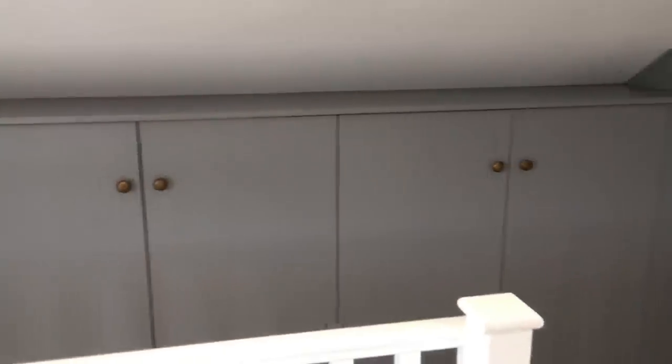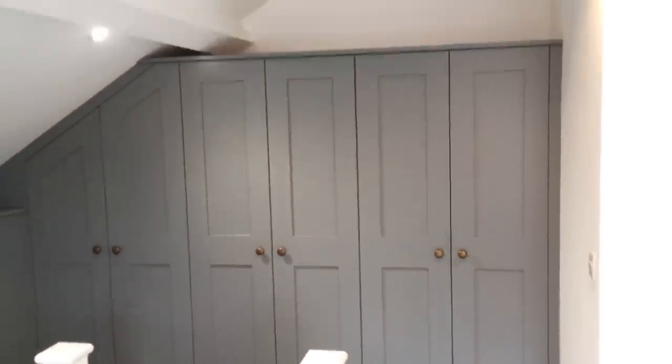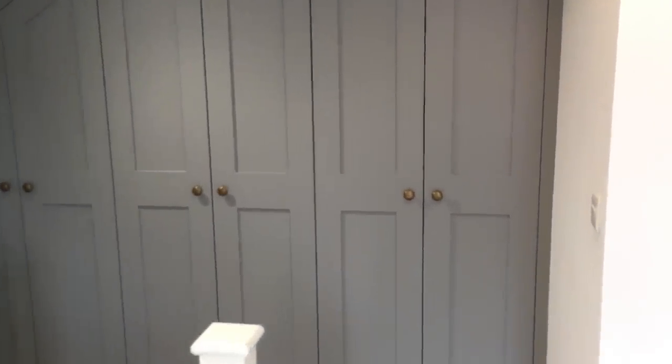And as I described there, of course, these parts are all pre-painted, which gives you this fantastic finish. I don't think you can get a better finish, and I have tried getting stuff sprayed after installation on site, and that raises lots of issues, like what you do where it meets the wall, you caulk it and mask it and whatever. But with this method, pre-spraying, you just get such a crisp finish, and I prefer not to caulk, especially when it's a dark grey that is roughly the same shade as the shadow gap.